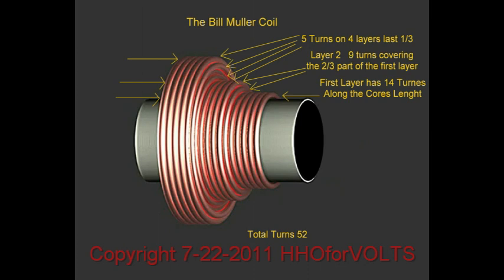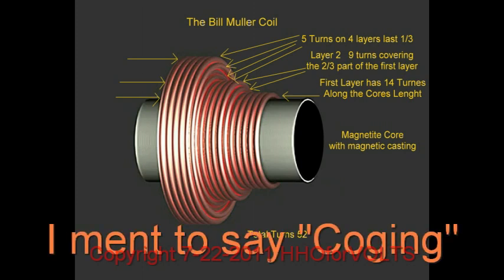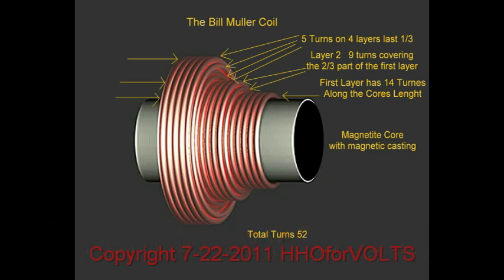To review: we want to use the minimum amount of wire. You can use a bifilar; we're using a quinfilar on ours, and it can be litz wire or not — it doesn't matter in this application since the frequencies aren't high enough to pick up any beneficial skin-effect current. We have the anti-cogging problem 100% solved, but every time you have anti-cogging you require more power to run the motor, so you'll never get back to over-unity. What we're building is on the scale of Bill Mueller's unit in physical size, but with simplicity — and when it runs, it's absolutely quiet with no cogging.